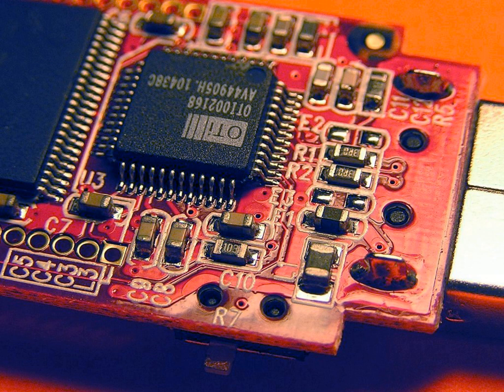Small errors in component placement are corrected automatically as the surface tension of molten solder pulls components into alignment with solder pads. On the other hand, through-hole components cannot be slightly misaligned, because once the leads are through the holes, the components are fully aligned and cannot move laterally out of alignment.